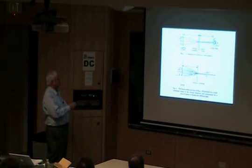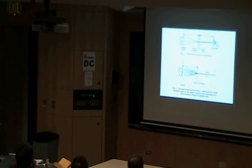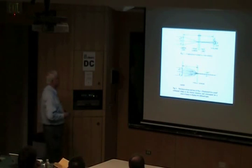Because if the focus screen isn't diffuse at all, your eye is going to get light only from the center of that camera lens. You see why? The angles are going to follow right through. So the main function of the focus screen is to make the out of focus image look blurry. And it's got the secondary requirement to keep your eye from accommodating to a moving image. It's got to do those things or you can't tell where to focus your camera.